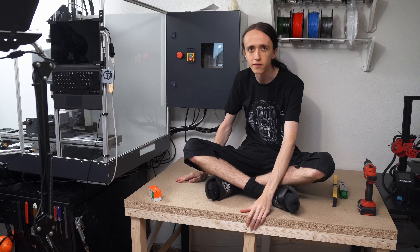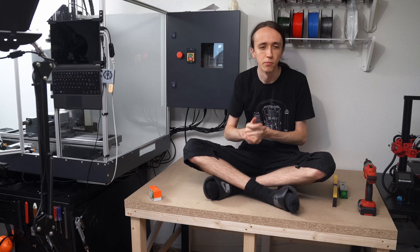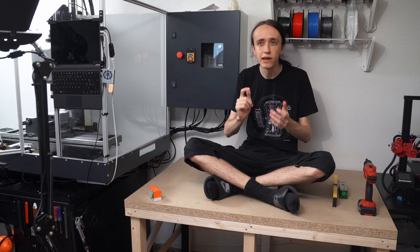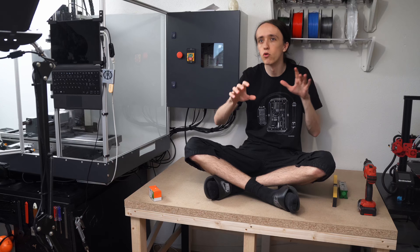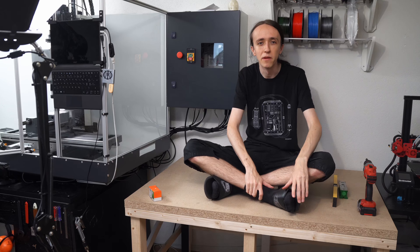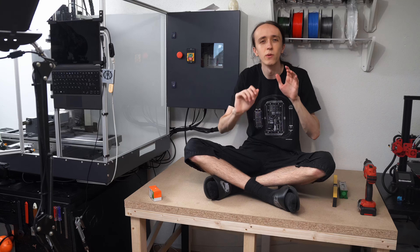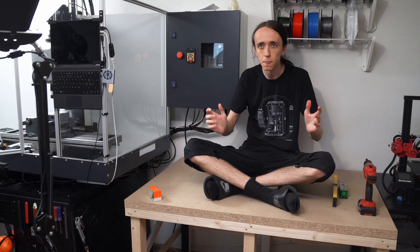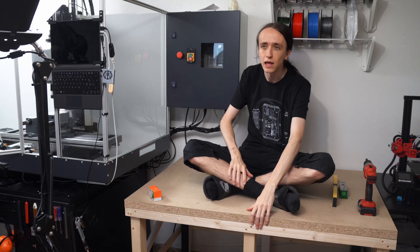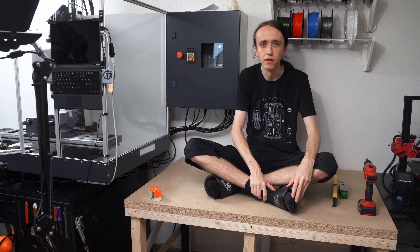What you can see here is the table that I built for it — of course it needs a sturdy table, and I'm trying to get the very maximum out of the CNC possible. It already is at the higher end of the hobby CNC market, as it does have linear rails and is using lead screws instead of belts. But price-wise it is still at or below the Shapeoko Pro, which would be the closest comparable machine in the pre-built hobby segment. What I'm hoping to do is keep the total price under the budget of the Shapeoko Pro, which was around $2800 without the spindle — and for me that also doesn't include an enclosure or a table. So far it looks like I should be able to stay under that budget, including the table and the enclosure, and almost including the spindle, since I am going with a significantly higher powered spindle than you would put on a Shapeoko Pro.